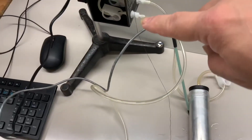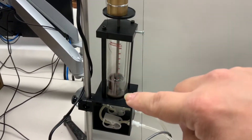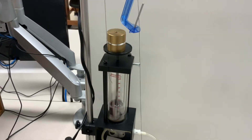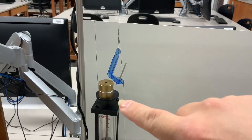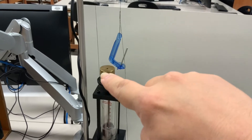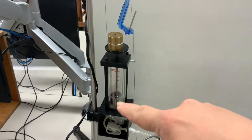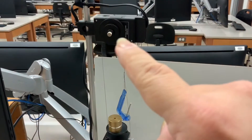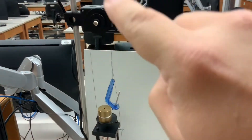The chamber is connected by means of a tube to a cylinder — essentially a piston — which is allowed to move upwards or downwards due to temperature variations. On top of this we have 205 grams on one side and 5 grams on the other, so overall we have 200 grams on top of the platform for the syringe. As the piston moves upwards or downwards, this much mass will be on there.